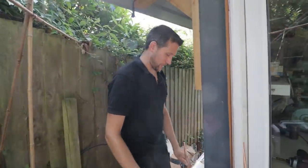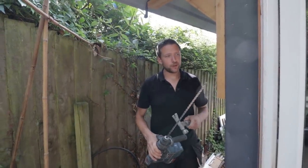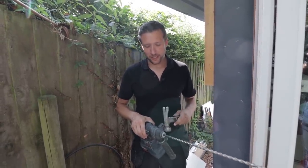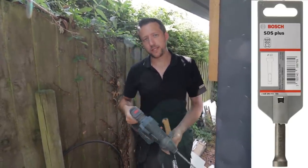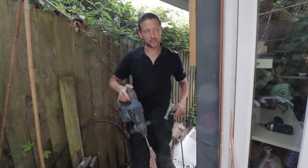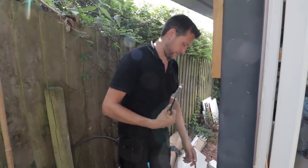We're using a power bank to power a fan just to keep cool - it's a little on the tropical side. Many an electrician has got busted knuckles from doing this. Somebody said you can buy an SDS attachment - I tried it in this drill which is 2.8 joules, not bad for a cordless drill, but it just didn't have the grunt to drive the rods in. You need a big SDS to drive the rods in. The theory is really good - you just sit it on top and hammer in hammer-only mode - but a big SDS would be better. Just do it with a hammer.